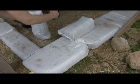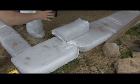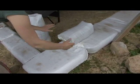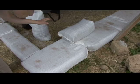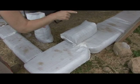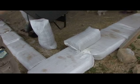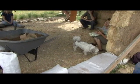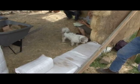You do that every so often down the wall. Once you get another course on, put the next barbed wire, unclip it, unroll it, clip it over here so it hangs and holds the next barbed wire. So you're just weaving that back and forth, otherwise the barbed wire tends to spring up and is hard to keep in place. Nice, low-tech, simple system.